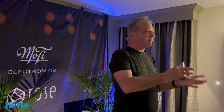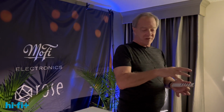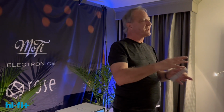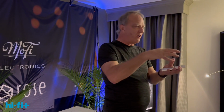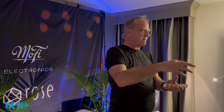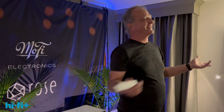So it's important when you're operating close to the vicinity of those cone resonances that you have a very linear magnet structure. And the other problem with the magnet structure is I've got to fit it all within the voice coil, both the bass driver motor structure and the tweeter. And often you're starved for strength from the magnets to create all the fluxes you need. So what I was able to do is create a new compound, we call it Twin Drive, because the tweeter magnet and the bass magnet couple together and drive flux through each other's gaps to increase the field strength in them. And also because I'm an identical twin, so I thought that was really cool, Twin Drive. So I had to come up with all this structure and squeeze it in there, and now I've got my drive unit. And so paper and silk, where we progressed.